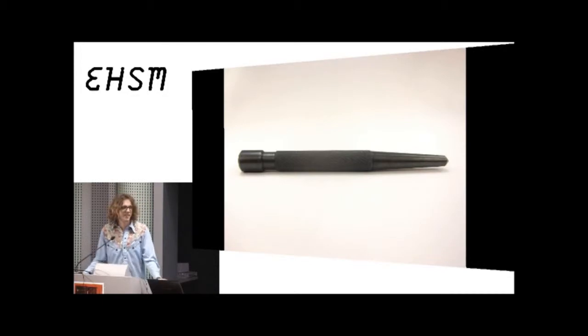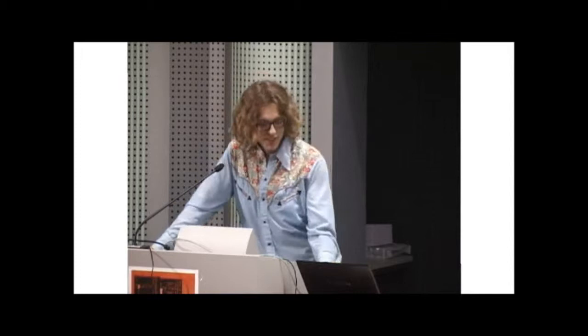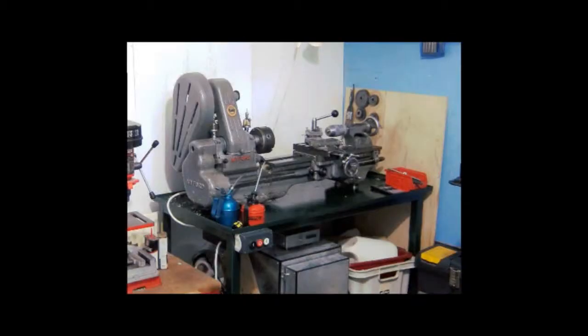This is my most recent project — I made this for my dad for Christmas. It's a tool called a center punch, a very simple tool made of tool steel, hard carbon steel. It's a simple pointy object: you hit it into a piece of steel or any metal and it leaves a little dent which guides a drill bit later on, so you can drill a hole accurately in the position you want. I made this starting off with some metal bar — and this is a lathe, my most favorite possession in all of the world.